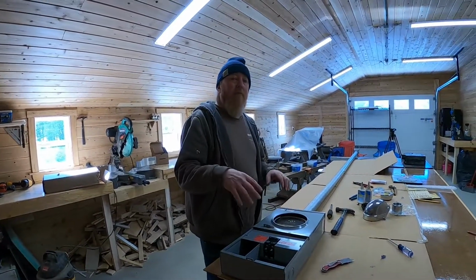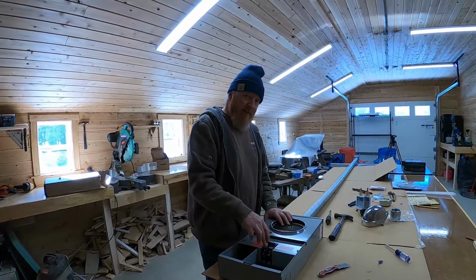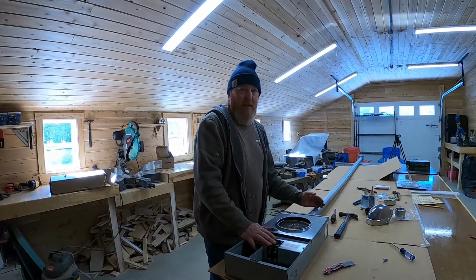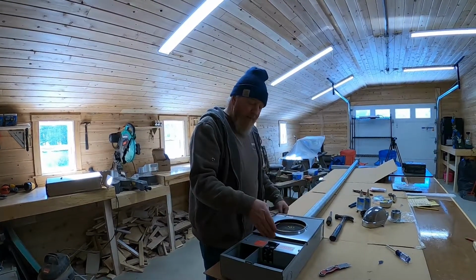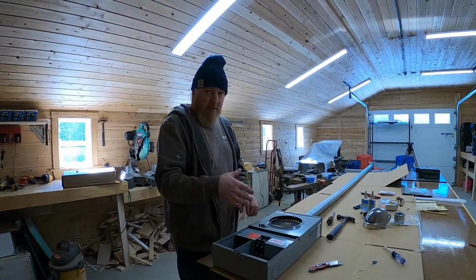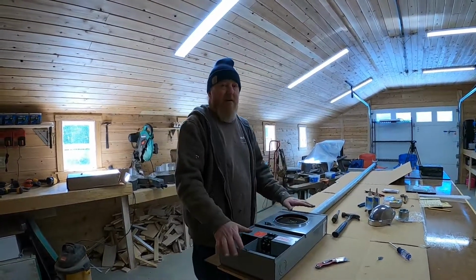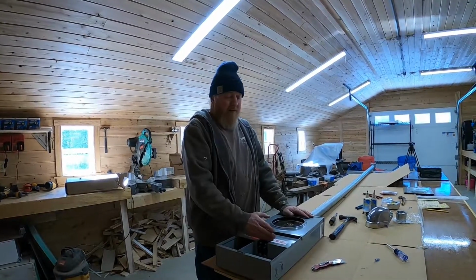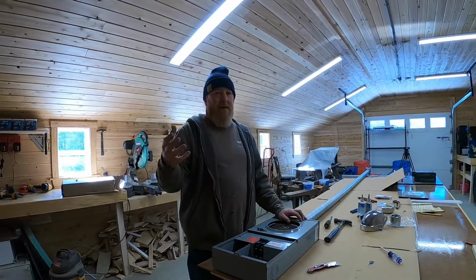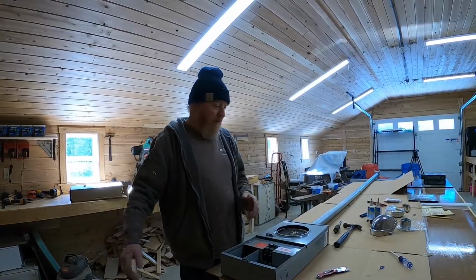So when you do an electrical service, at least in Maine, and I think most states are this way, the service disconnect is where the utility responsibility is, if you will. You own the equipment, but up until this point, they keep you locked out of it, because it's not metered and not fused, if you will. From here on is the homeowner's responsibility. So this is another good reason, like in Maine, to do the disconnect on the outside of the building, is now the utility doesn't have to traipse through the house, go down in the basement or wherever it may be and look at your electrical panel, because that's a different portion of the electrical work.